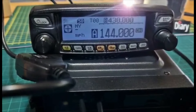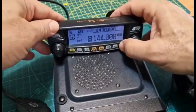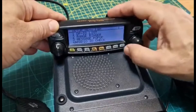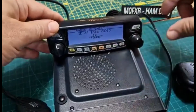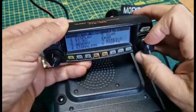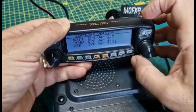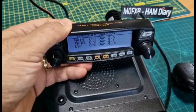You're going to need the latest firmware and your radio ID. To get your radio ID, hold down the DISP button, turn the knob to GM, push DISP, then go down to number four — radio ID — push DISP, and there's your radio ID number. Mine is F5NNE. To check the firmware, hold down DISP, go to number 13, then go all the way down to software and push DISP. Make sure you've got the latest firmware — look on the Yaesu site for that.